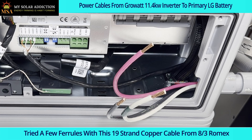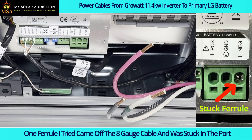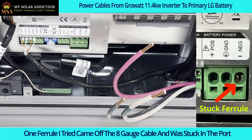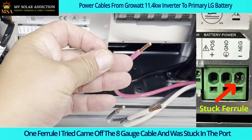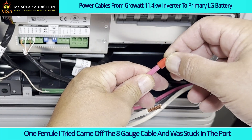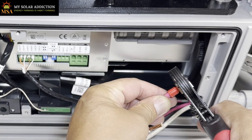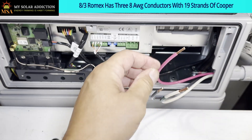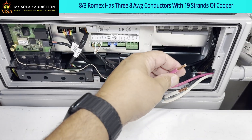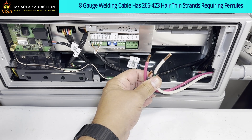We're going to hook up power to this battery. We have a little problem with a ferrule, so we're going to try a different ferrule this time. Hopefully it won't get stuck - this is 8-gauge, 8-3 Romex. We'll try this one that has a little skirt on it. But it's not staying on - I can just pull it right off. I think it's because of the kind of wire on the 8-3 Romex, so let's go ahead and plug them in using bare wire.